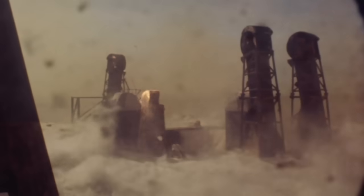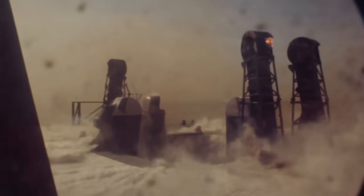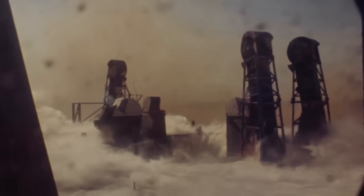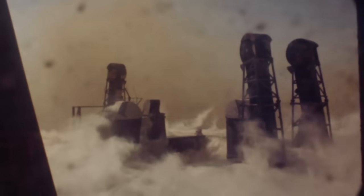There's an awful lot of water coming down onto the pad now. You'll start to see water and debris swirling around as the vehicle has moved away, some of it getting on the quartz window of the camera. The burning of the insulation material is starting to go away, and you're seeing steam that's no longer being blown away by the exhaust — giving a better idea of just how much water is being dumped. It's still so hot that a good bit of it is flashing into steam. Pretty much all of the char is done and there's no longer impingement from the vehicle.